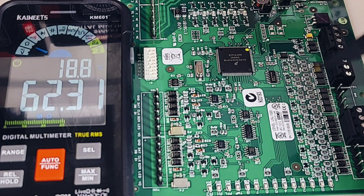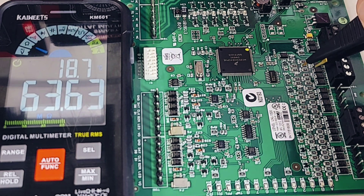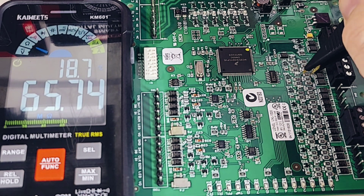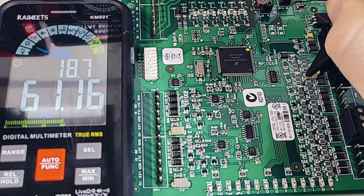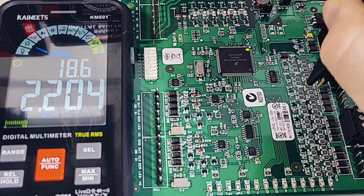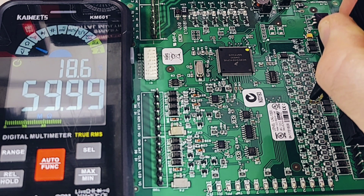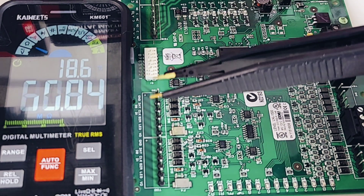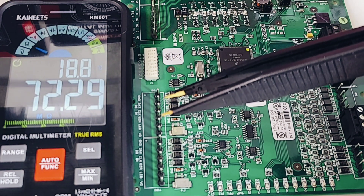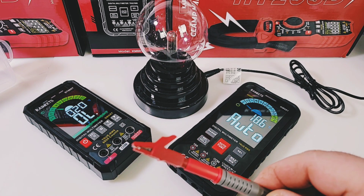Here's a perfect example — when you have a lot of components to troubleshoot, look at them all. You could go in there with your standard test leads, of course, but it's going to take a while. Much quicker to go in with an SMD tweezer like so, and you can just work your way down the board, easy breezy — super handy. I just can't say enough about using tweezers when doing something like this. A lot of versatility, a lot of usability for not a lot of money.